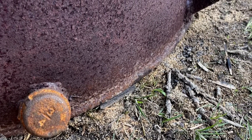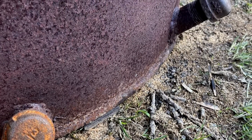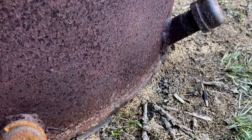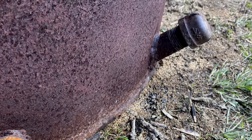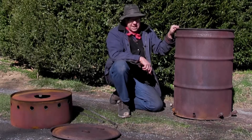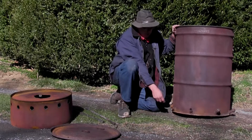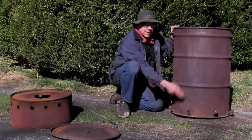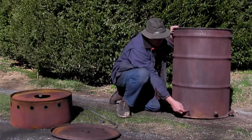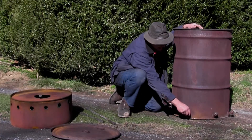You could just cut little three-quarter-inch holes all the way around the bottom. We need to be able to seal it up when we're done — you could seal it with mud, but I prefer something more positive because it's hard to really get it sealed well with mud. So I've taken some three-quarter-inch pipe nipples, cut them on an angle, cut a hole, and welded them around the hole so I can close these vents off at any time.